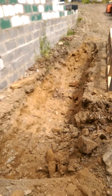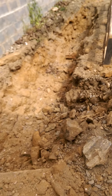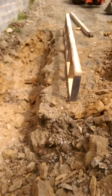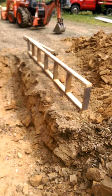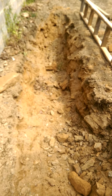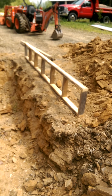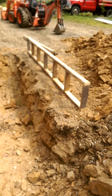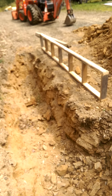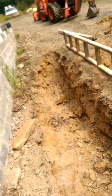The pit house is going to be 12 by 6 — that's 72 square feet — and pretty high. If you count the pit, it's at least three or four feet deep. This 12-foot side wall comes to the edge where I'm gonna dig in my steps. I'm planning on using tires, filling them, and making them staggered down like steps, but we'll see how it goes. The reason I'm going 12 feet is because you can get 12-foot corrugated clear plastic roof panels so I don't have to cut it down too much.